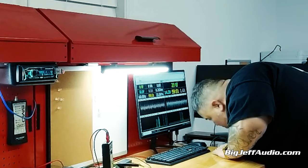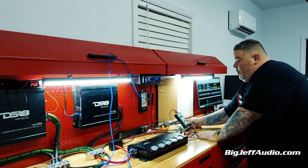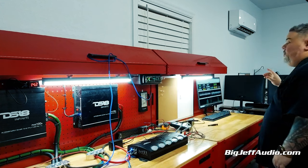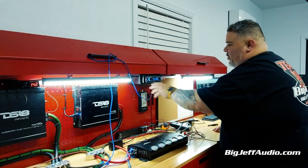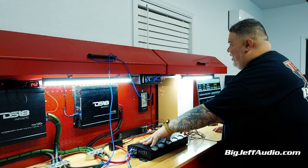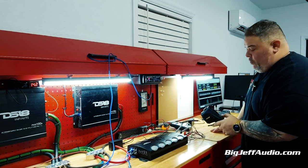I'm going to go ahead and select this down to 1.3 ohms. The reason why I'm doing that is because it's a static load, which would be pretty rough. I'm going to turn on my SMD again — real-time power. We're going to turn on dummy load. We're going to get this track ready, which is 40 hertz. And it's a burst, so it's not just a constant. The amp is somewhat warm. We can actually get this baby out because we've been hitting it with multiple, multiple hits.